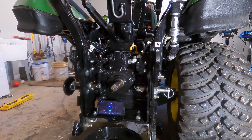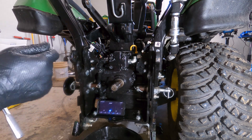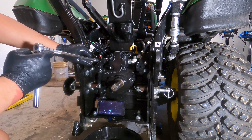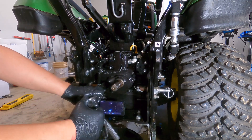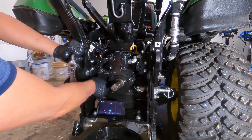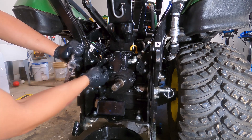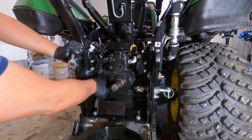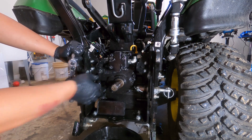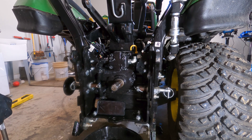One thing you might do — this is a 13 millimeter. We did it in less than seven minutes. You might take this bolt loose if you want some additional freedom. All this is is a bolt that helps secure this metal piece of pipe — it's really not necessary but it's a nice to have. By loosening this bolt you'll get a little bit of flexibility, though honestly you don't have very much flexibility because of the ROPS anyway. If you feel like you're struggling and can't quite get it in there, go ahead and do that. So that's it — stock pump to an extreme capacity pump, pump only, in less than seven minutes. Hope that's helpful, and if you have any questions feel free to comment below.